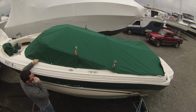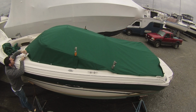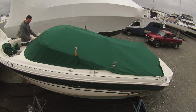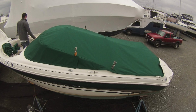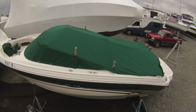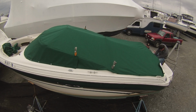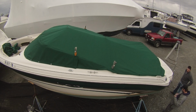In this time-lapse video, you'll see we make our way around the boat, removing the fitting snaps and pressing the permanent caps and sockets using the Hoover snap tool. Pressing the new snaps in place took about 30 minutes, and the whole process is pretty easy because the positioning caps hold the canvas in place, so it takes the guesswork out of positioning the canvas.